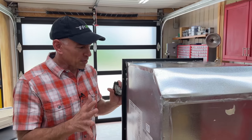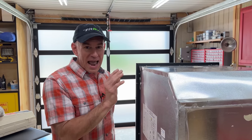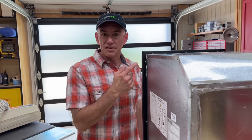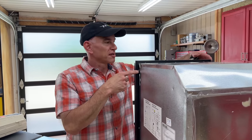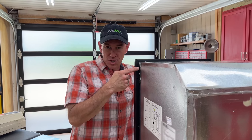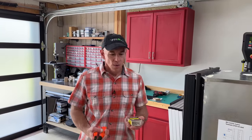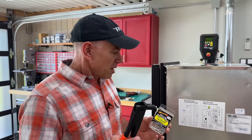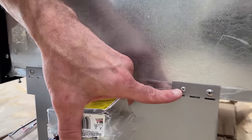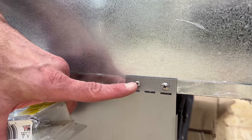Well, a couple things. First, you're going to laugh because you're going to think it's silly, but it's actually down to this much space. I'm going to remove these mounting screws. That's going to save me more than two millimeters for each screw head I can get out of there. So that's 4 millimeters, that's like 3/32 of an inch in width. I'm going to replace them with aluminum pop rivets. So I've already done one down here on the bottom, right here. You can see there, that's what I've replaced it with. That's the aluminum pop rivet. There's the original screw. Clearly, I've saved some width there.